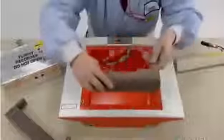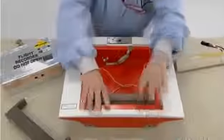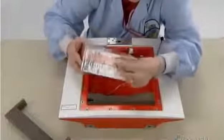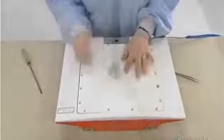locating signal via the antennas, the second of which they now install into the component cavity at the top of the box. Then they install the battery that powers the transmitter for 150 hours. They connect the battery to the transmitter in the fireproof box, connect the transmitter to the antennas, then screw the cover to the aluminum plates embedded around the cavity's perimeter.